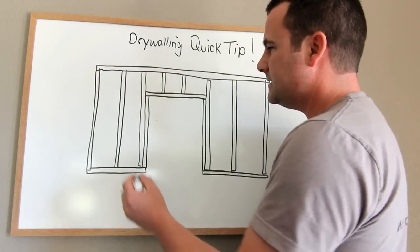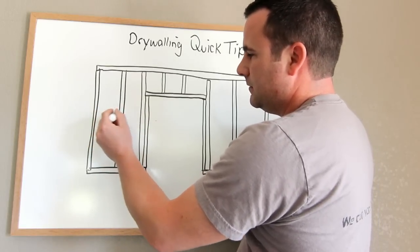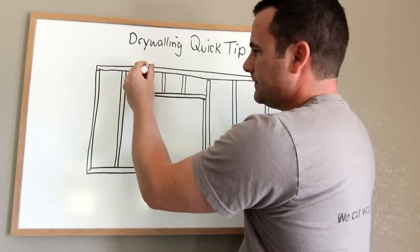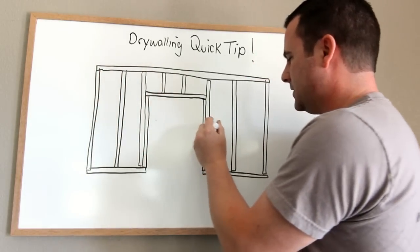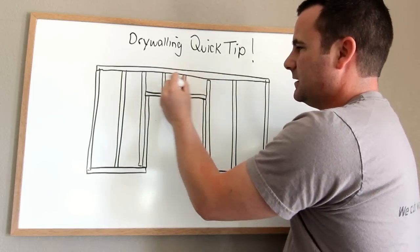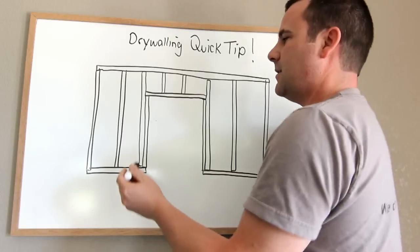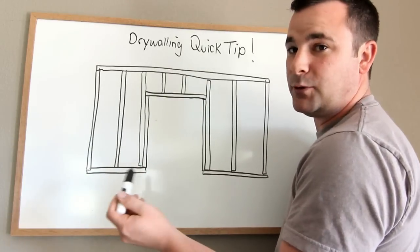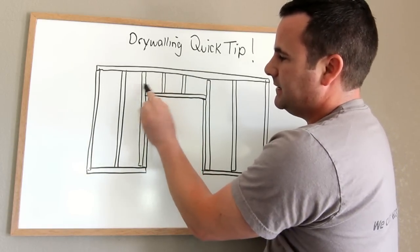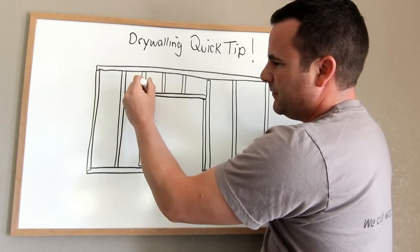So instead, I've seen 100 times where people will do a piece of drywall like this, and then they'll do a chunk over here, and then they'll fill in the chunk in the middle. First of all, the reason that's hard is because you have to cut like 3 pieces of drywall, that's more work. Plus then you need backing in here, because if this piece is lined up with the door opening,